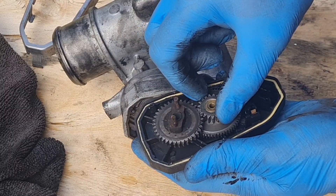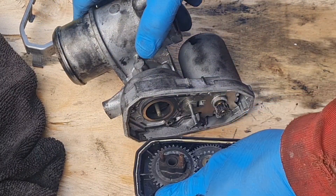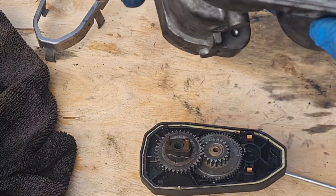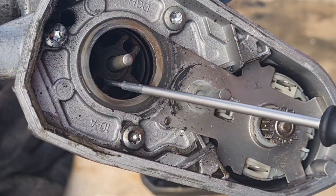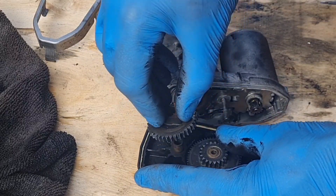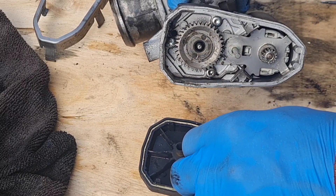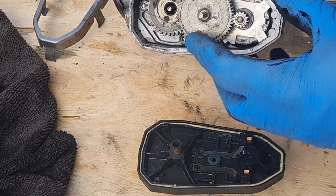So that's what's inside. Is this not a bit technical for an EGR valve? All gears in there. These two prongs that stick up here clearly engage in those two holes in there. That's clearly where these gears engage. So we can take that gear out — that obviously goes in there. This one obviously sits on the top here and engages with the motor.